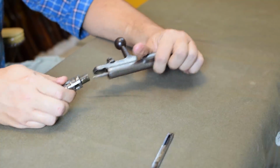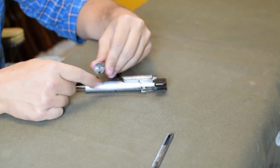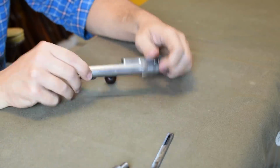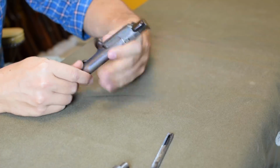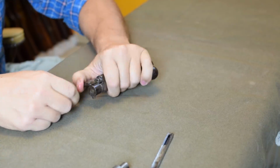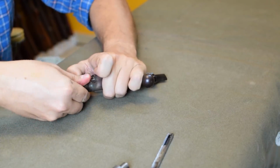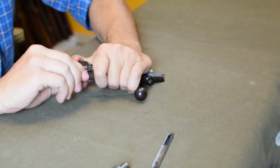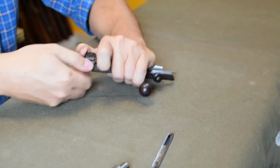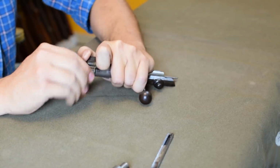The bolt head should be able to rotate and come free. The extractor's set in there. That's all we know. Although I will say, it's now much better for gas control. See how it's recessed in there? It's a pretty big improvement. Now, bolt body, right? Previously, we would put pressure down on this firing pin and rotate this guy at the rear. Now we get to take the safety itself, which is on a spring, and compress it inward and rotate. So no more putting weight on that firing pin unnecessarily. And I'm sorry that there's not a lot to look at, but there's a fair bit of pressure at play here, and I'm trying to do it while being on camera. So I'm just rotating this rear nut slash shroud to the left.